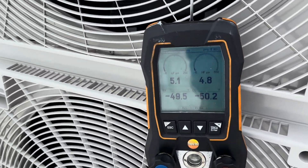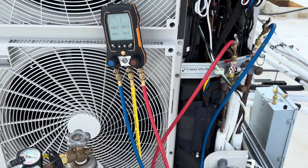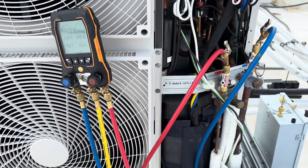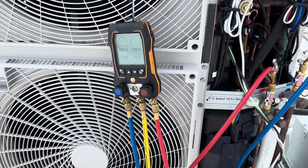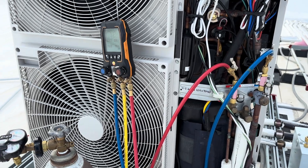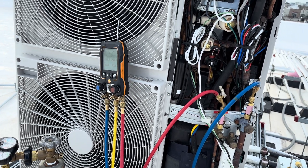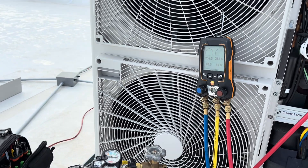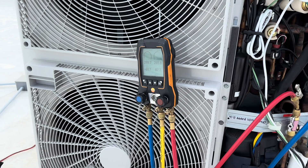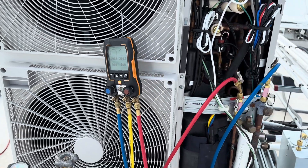This will probably take a few more minutes to pull that last little bit out. Now we're putting nitro in it — we're going to get it up as high as we can. 500 PSI is standard for VRF, but it's really 600. I'll probably have to go get some more nitrogen. I took about 14 pounds out of its 18, so I know it's four pounds short — that's about 24–25% of its charge that it lost. It's not as low as we thought, but it is low.